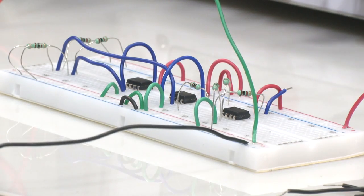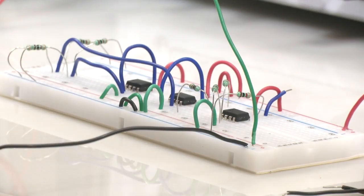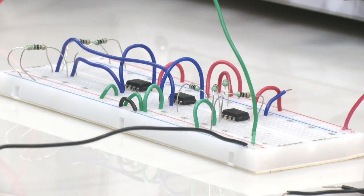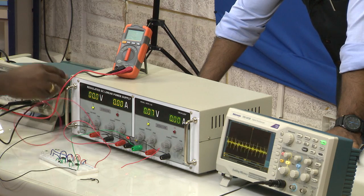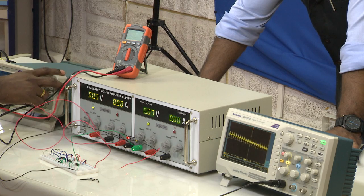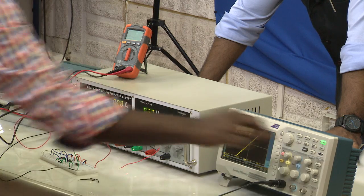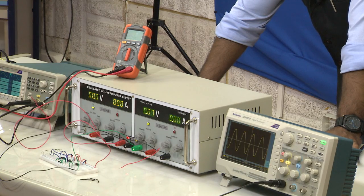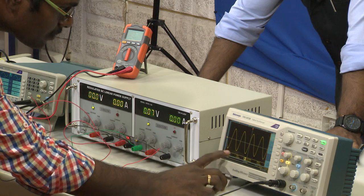So, when you always take a probe, always try to see whether probe is working or not. You have to connect the probe in a proper manner. So, you understand whether the voltage that you are applying makes sense or not. So, a lot of things you have to understand, do not just think that once you are applying 1 volt it is done. You have to check it with oscilloscope, you have to check it with your multimeter, see the probe whether they are properly set, and then you apply to the circuit, okay.